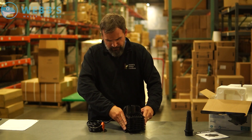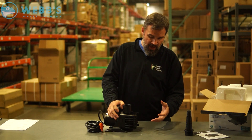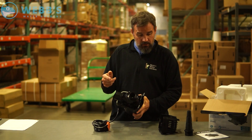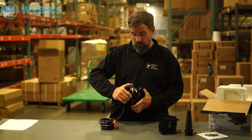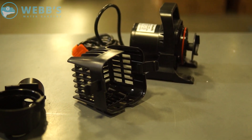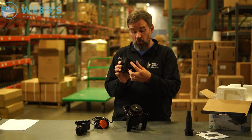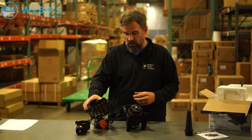These are very reliable and super easy to work on — they really don't require any tools. You have that two-snap pre-filter screen you can pop off with one hand. And if you ever need to service it, that's obviously your first step. Then the front end, the volute, you just give a quick quarter turn and you can pop that off too. Even further, with no tools, if you needed to remove it, the front end of the screen has a built-in tool — you just lock this around the impeller, give it a quarter turn, and that rotor comes right out.